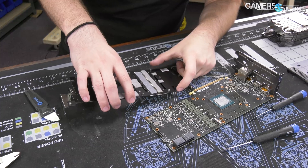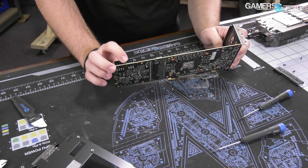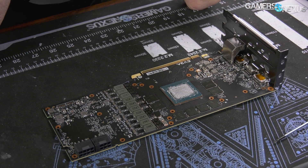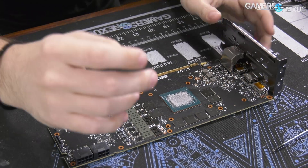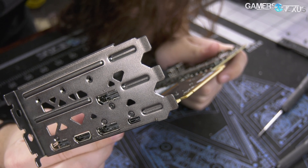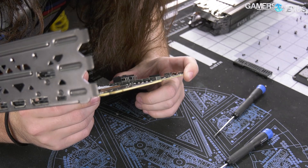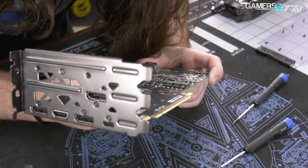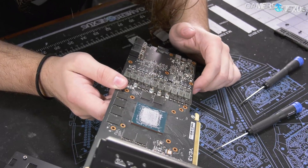That's the primary part of the cooling for the VRM, and then VRAM cooling is all around there. The board moves to two power headers — one is blocked out rather than the single power header on the original 2070. For components, it is Micron memory on this particular model — though there's no guarantee that's on all of them. For the MOSFETs, they are ON Semi 3170s, which look familiar for this generation, and that's for all of the MOSFETs here.